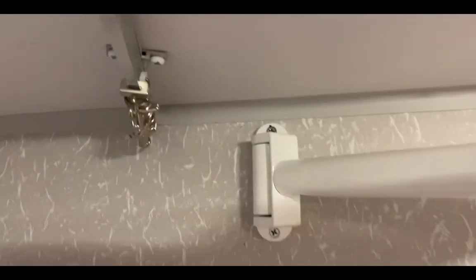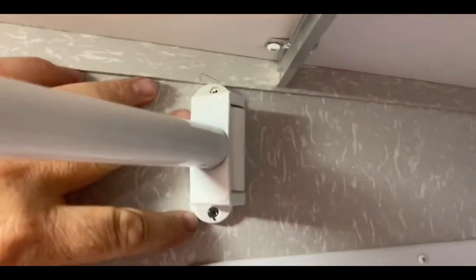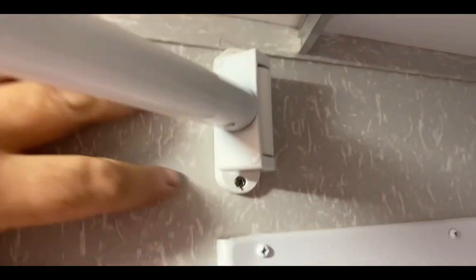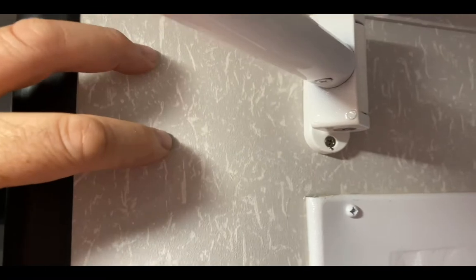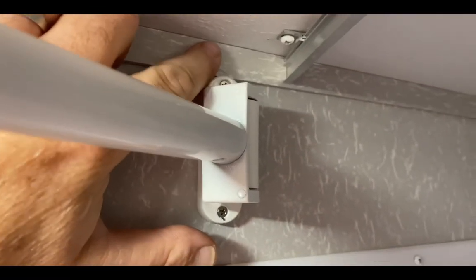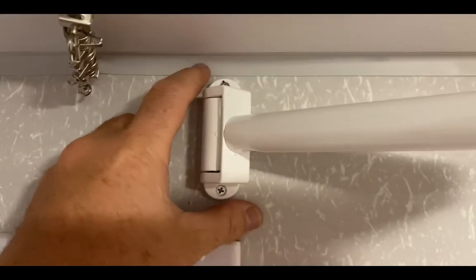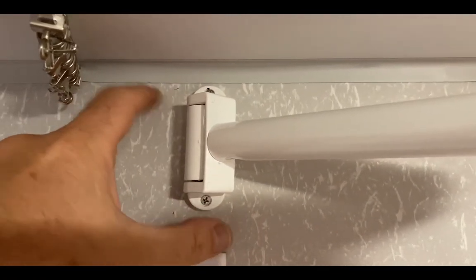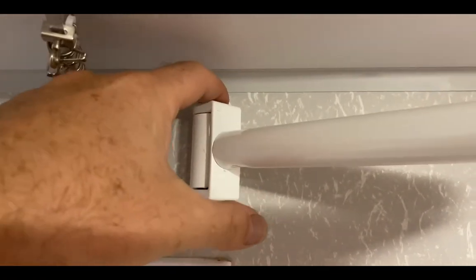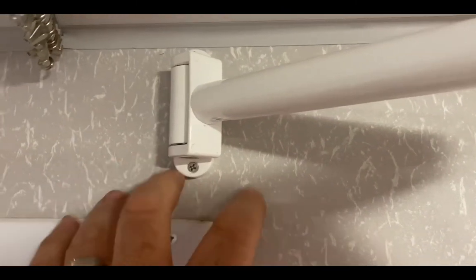But my concern, as I was saying, is right here where these screws go in, here and here, to give you that girth. And the same thing I did on this side. The nearest stud to this side was way over here at the door frame, or I would have had to put it all the way up to the ceiling, which I didn't want. I wanted some breathability here. And then same on this side, I got lucky, the ceiling brace up here is a little bit lower, so I got this one to grab, but this one's kind of just through this paneling. There's really nothing on the other side of this.